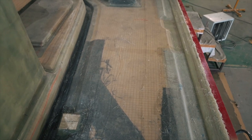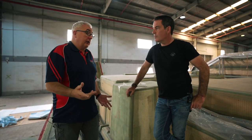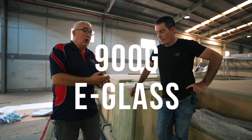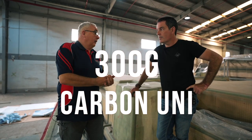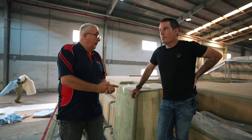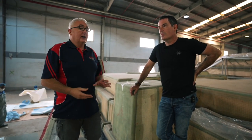There's a lot of carbon fiber here. When we use carbon fiber we can save about one-third of the weight compared to normal E-glass, especially in the uni-directionals. The uni-directionals are one-direction fibers acting like a beam or a bridge structure. Where you would currently use 900 grams of E-glass, you can drop that down to one layer of 300-gram carbon uni — a big saving. Usually with 900 grams of E-glass you'd need maybe 700–800 grams of resin; with 300 grams of carbon you only need maybe 250 grams of resin.